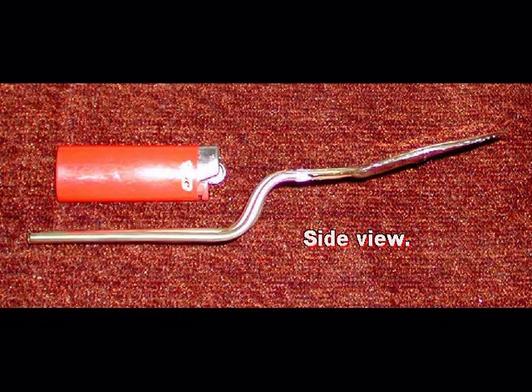It is not necessary to do fancy bending on the tubes — they can in fact run without bends from inlet to outlet. It is important to have the inlet about one and a quarter inches above the outlet when installed in its running position, and the outlet is better if it is parallel to the water line. Tube depth when in the water should be about one quarter inch.